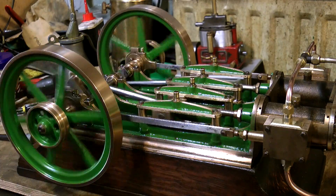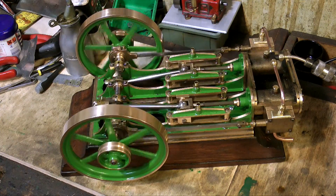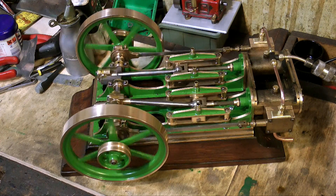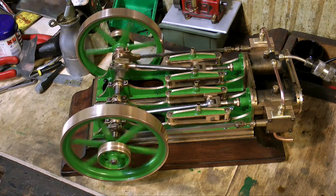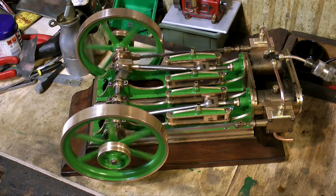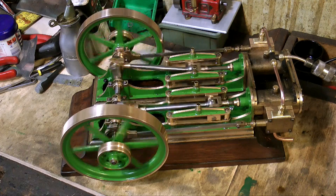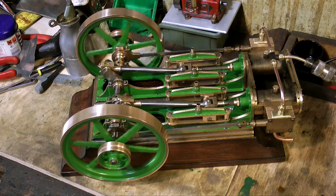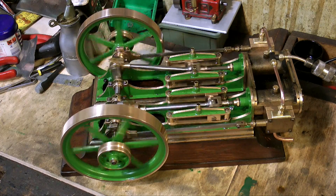This is sounding quite good now, so I think I'll leave it at that. The next thing to do is to paint the cylinder cover. But before I go into that, I'll just mention the flywheels. Throughout this rebuild I've been talking about the lack of concentricity in the flywheel department. This is due to the flywheel center bosses not being a hundred percent and the crankshaft being slightly bent at both sides. I can put this right, but I daren't show it on the video — suffice to say I will be using a dial test indicator and a large block of mahogany.